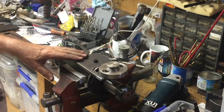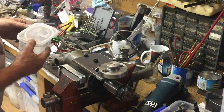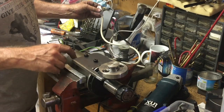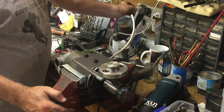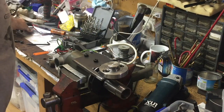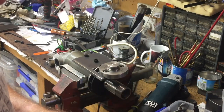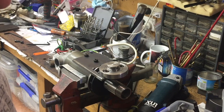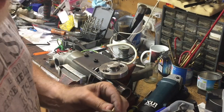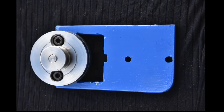It's finished. In this plastic box is a full wave rectifier which takes a 240V power supply and converts it to direct current. In the process the voltage will be increased to close to 400V, but the motor runs at 180V, so there's a potential for burning it out. I bought a double pole double throw switch which will allow me to switch directions, but actually the reason I bought it was to switch between full wave and half wave rectifier because of the voltage being too high — half wave will give you half the average voltage. Finally, with a coat of paint it's looking quite good.